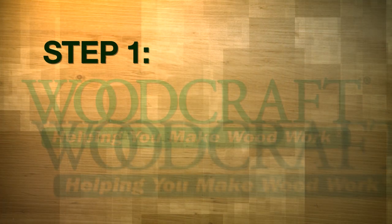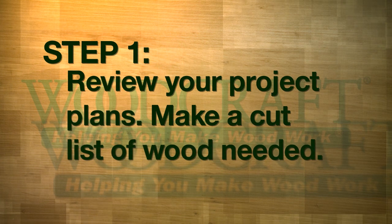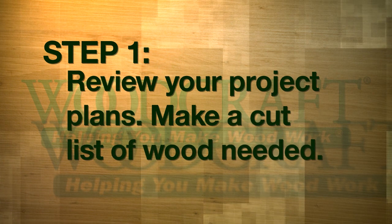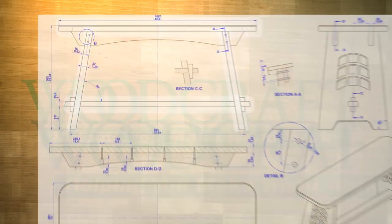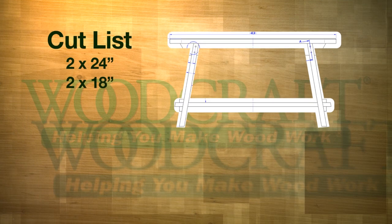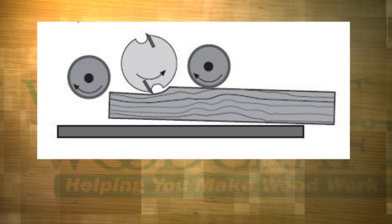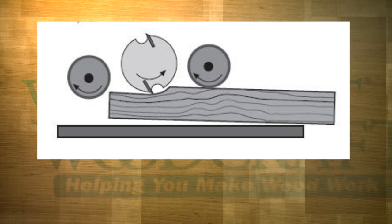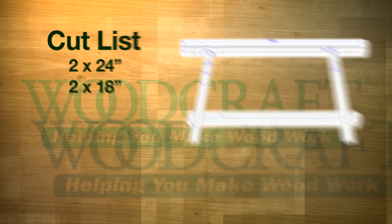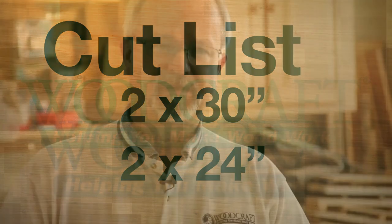The first step in the milling process is to review your plan so that you've got a cut list of material needed. You're going to cut that material down adding six inches to compensate for snipe, which is basically a little deeper cut at the front and the back of each individual board going through your planer — this is waste material. On commercial planers you'll have snipe; on small lunch box planers there won't be as much, but you still need that extra amount for cutoff and waste.